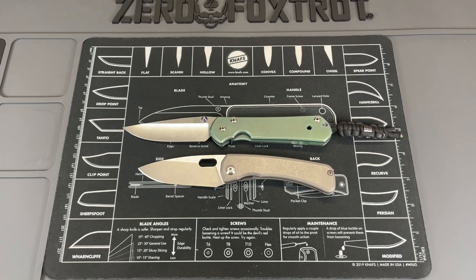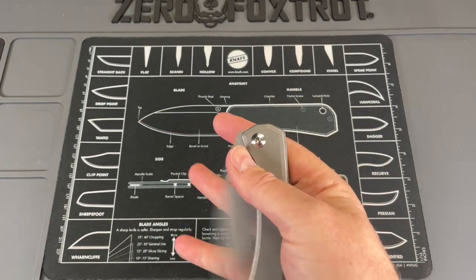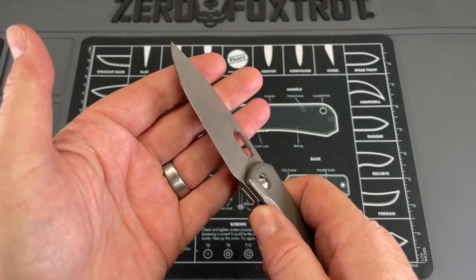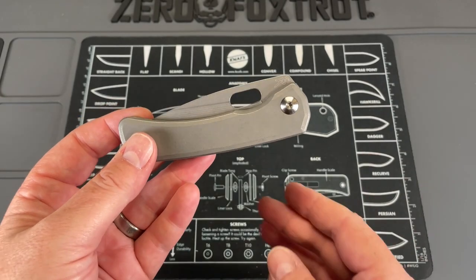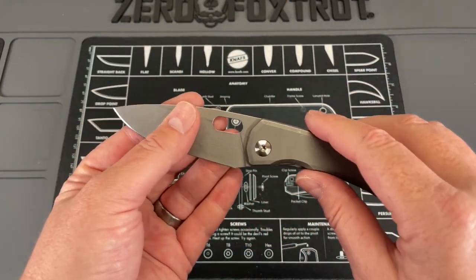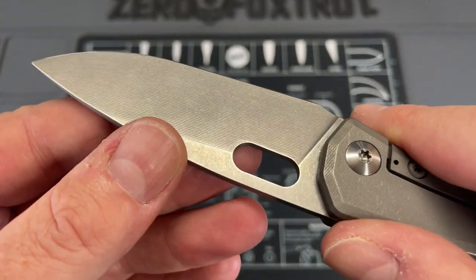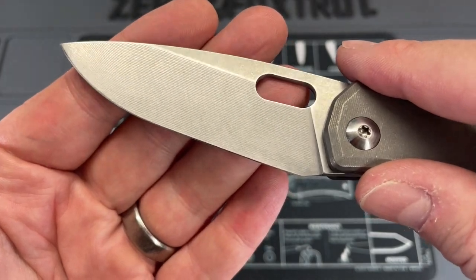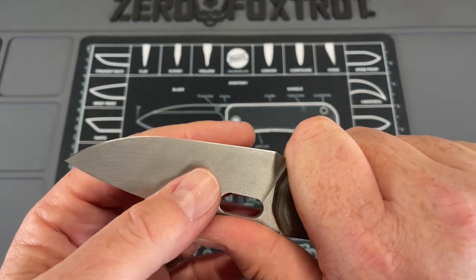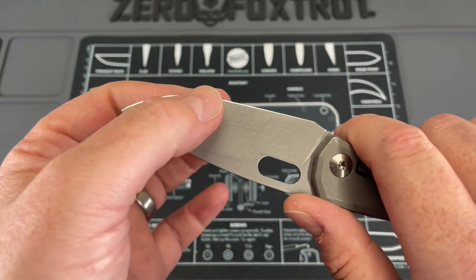That's a knife most of you are going to know in the knife community. So let's talk about how amazing this knife is. When Alex sent it to me, I had heard people gush over it in my membership community and on the Gilded server. When I got it, I was completely amazed. You've got a drop point blade done in Cruwear at 64–65 Rockwell. This is a machined blade — you can still see the milling marks where it was done on a mill, not on a grinder. It comes down to a very unique plunge that allows you to get way up on it on these titanium handles, clear up against the blade. There's no actual sharpening choil — the sharpened edge just doesn't start until there. It comes down super, super thin.